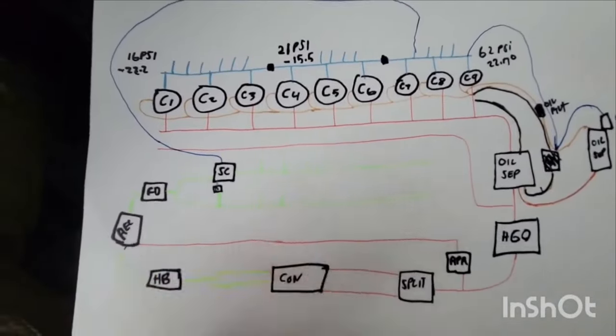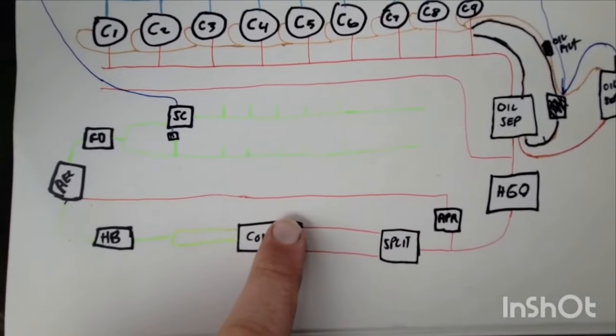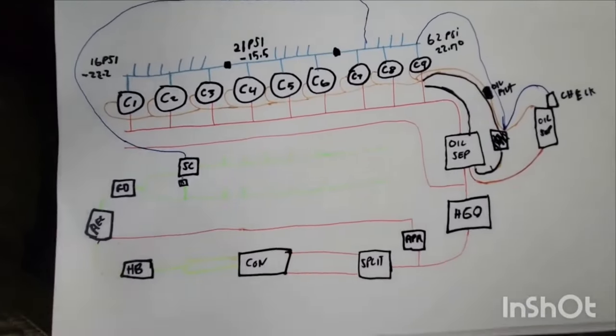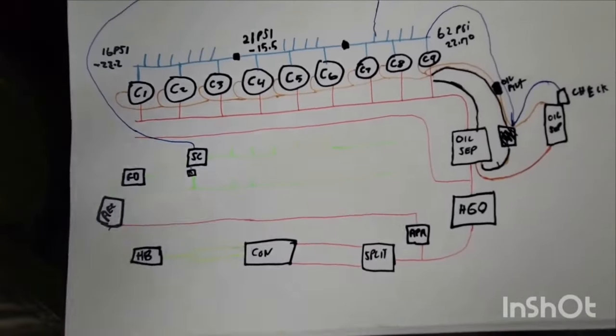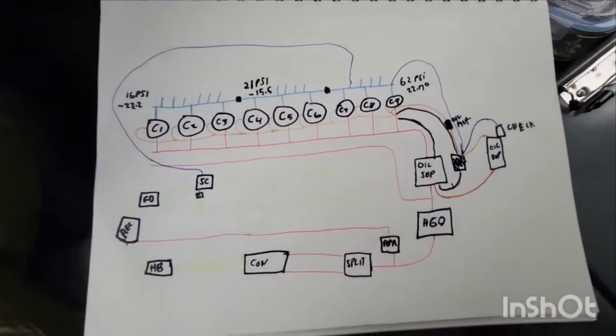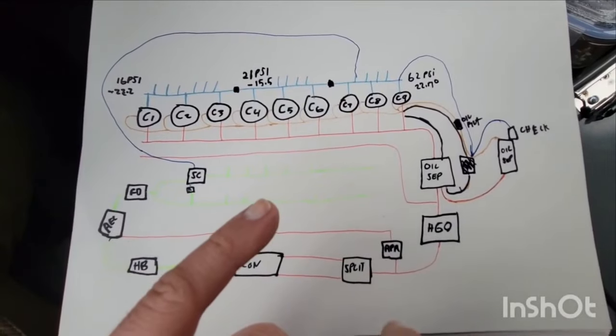High discharge though, mostly condenser. Is it plugged? Do you have all your fans? And what's the weather like? That's 99% of high discharge. So next up, we're going to go to low suction. I broke it up into three main things. Are all the compressors working?